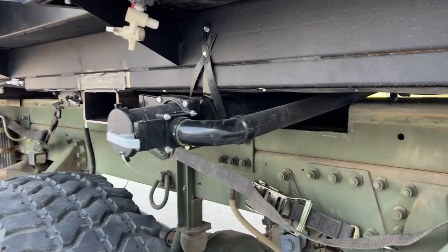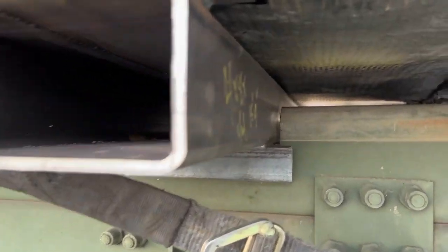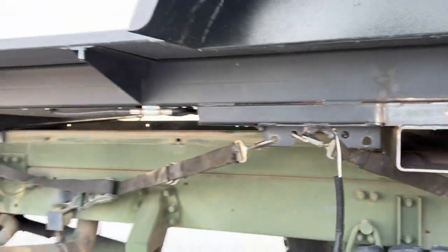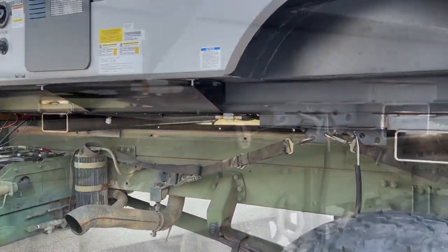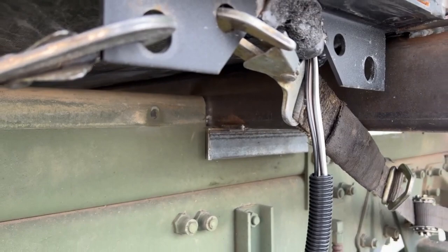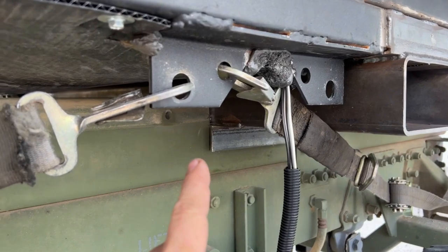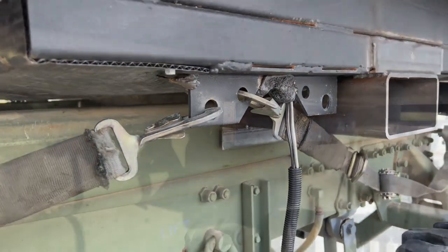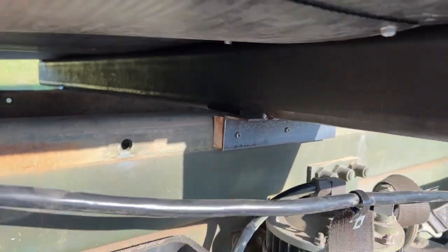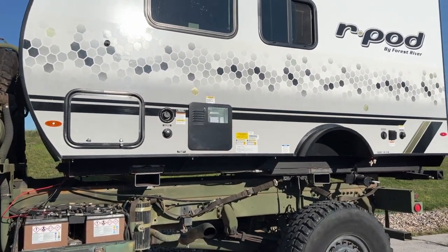It's all sitting down on there now. The hole for the septic is cut there. And there's a hole that the channel is sitting in in the rear, which drops the rear so that everything sits level. It will also prevent the rear from going forward or back and side to side. For now I'm still going to use the straps to hold it down until I can get to building the next phase. The wood blocks are in place now on all four corners, which means the camper is actually centered on the truck and it's pretty much in the final position.